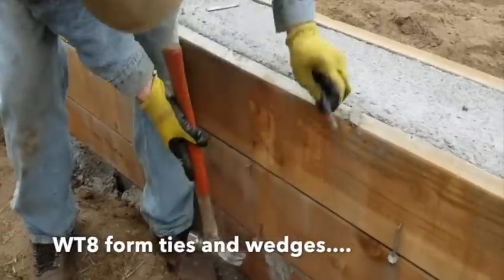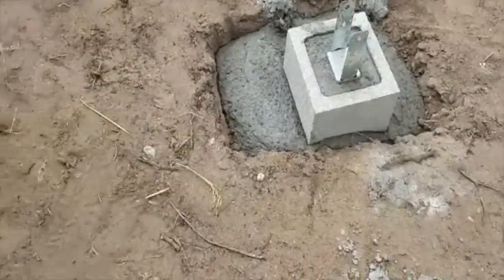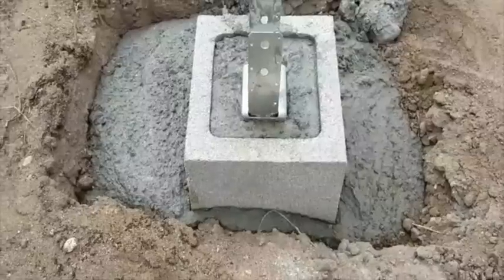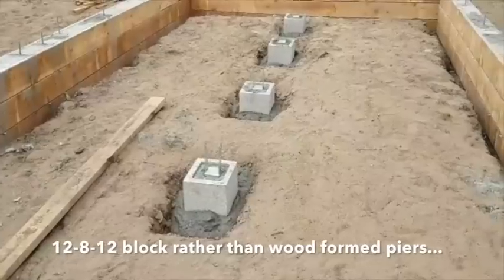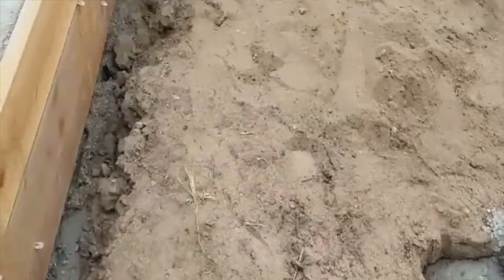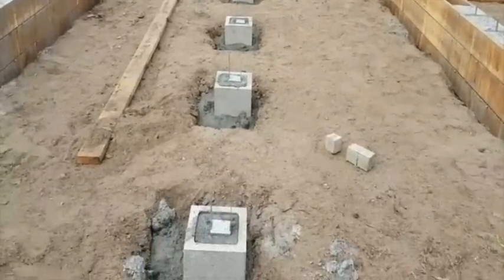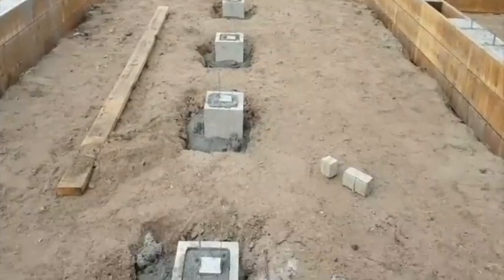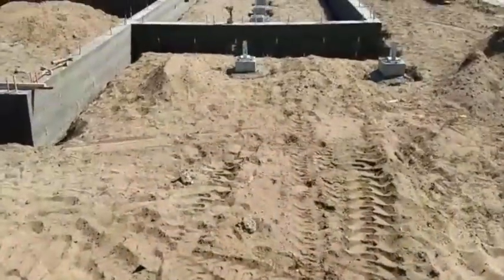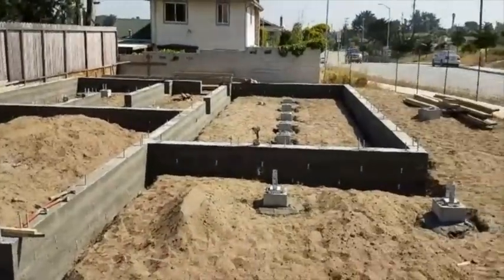I like to save all these wedges — they're about 15 cents apiece. Another little trick here for my interior footings for my girders: I like to use a precast 12-8-12 concrete block rather than forming out of wood. They're four bucks apiece and the labor savings are nice — you don't have to form them or strip them. I wet-set all these things with a nice string set up. As I'm pouring, I pour the blocks full, drop them in place, and put a small level on the anchors for my 4x4 post that'll go to the girder. While we're all stripped, we're ready to start plating, putting our girders in, and framing the floor.